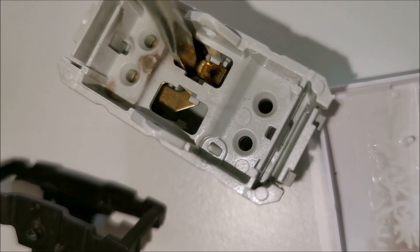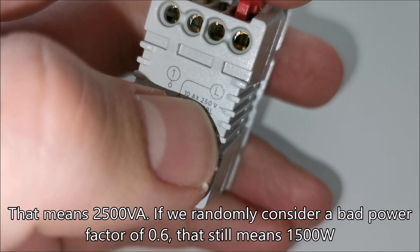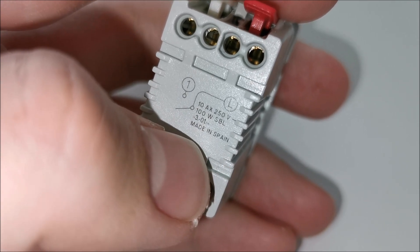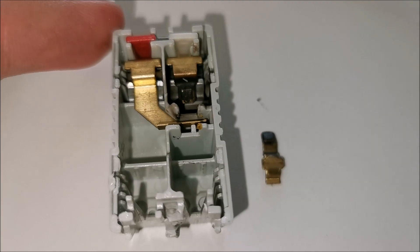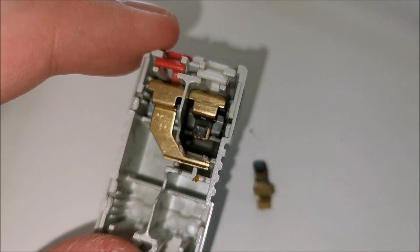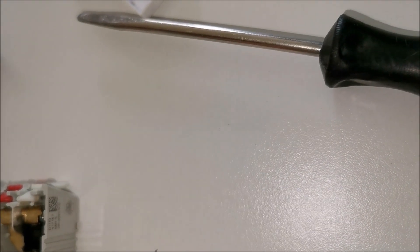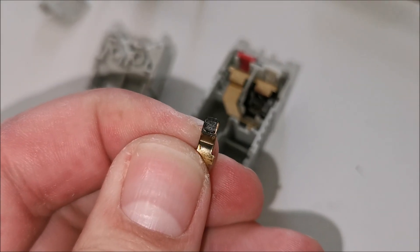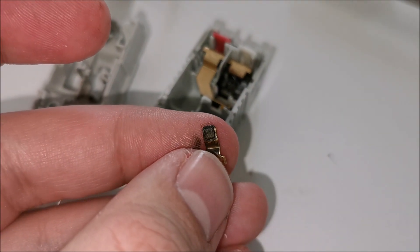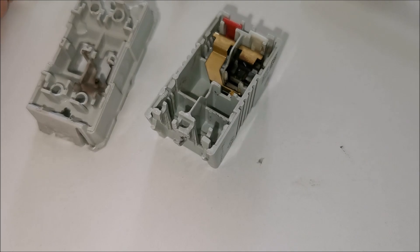It seems to be working normally, and I didn't overload this thing — from its specs, it's 10 amp maximum at 250 volts. I think I'm even below 100 watts, honestly. This switch is really, really black — like it has been severely overloaded. But the issue is that I know for a fact that it hasn't been. This is weird. What happened to this switch? Is the rating on it not real?